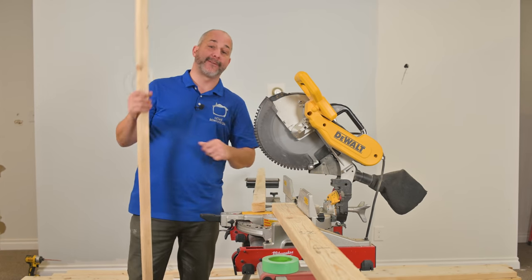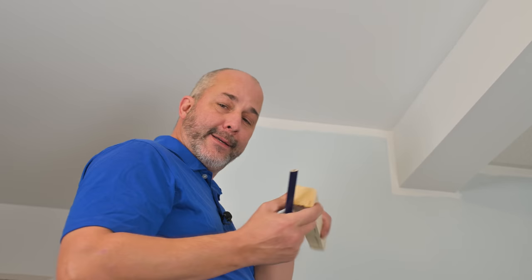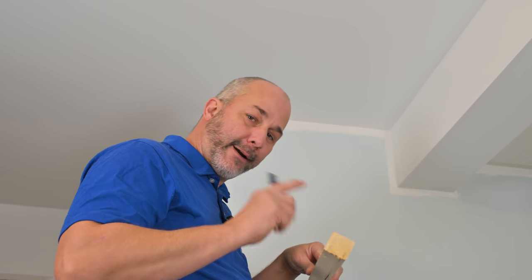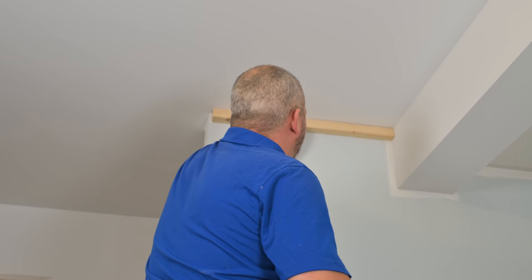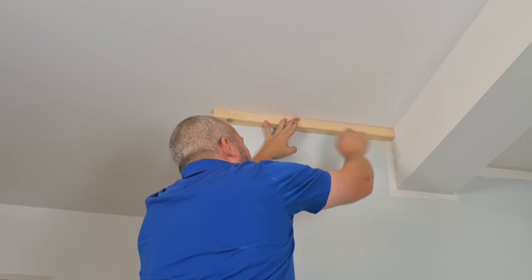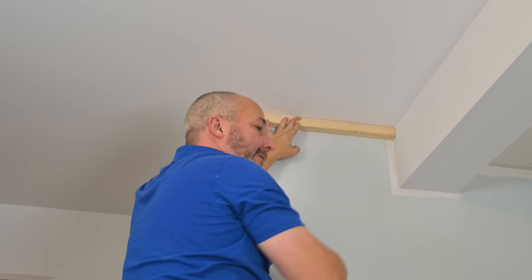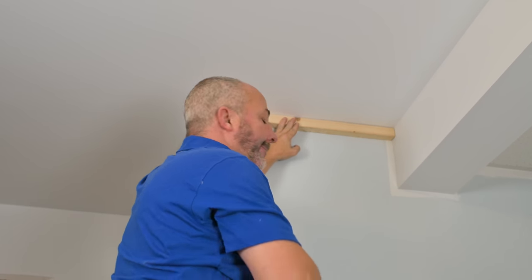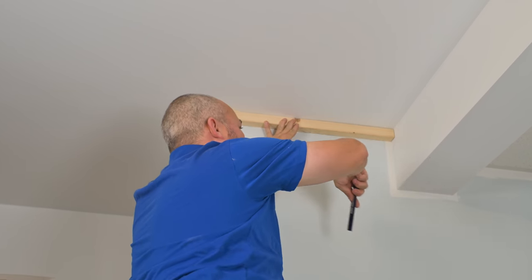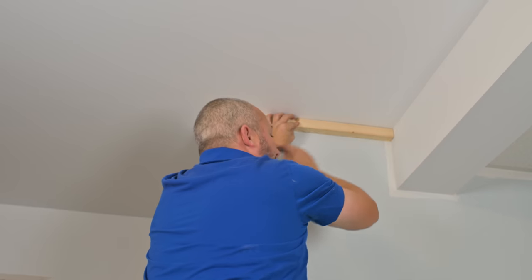Now we've got our backer material — let's go install some crown. Just for clarification, I'm using MDF crown molding from Home Depot, five and a quarter inch wide, and this backer is cut one and a half by one and a half — you can buy these off the shelf as a two by two, or just rip it off a two by four. Traditionally I would put it up here, and that leaves enough room for the molding to pass along, and then nail right through the middle into this wood. So even if the drywall is attached to masonry or concrete in an apartment building, you can attach this with Tapcon screws or wood screws if you have wood, and put it up here for traditional installation up to the ceiling.